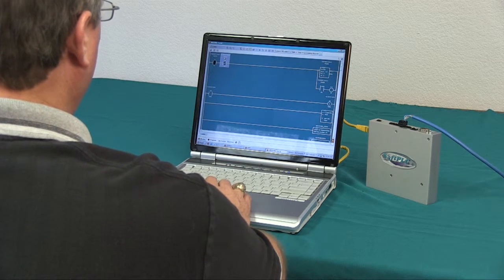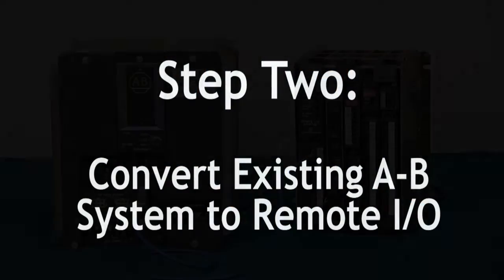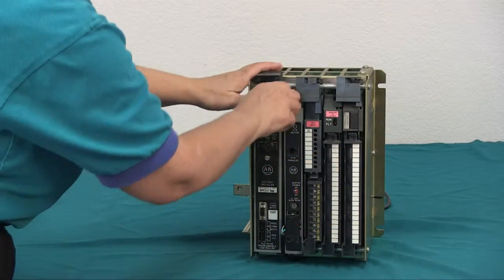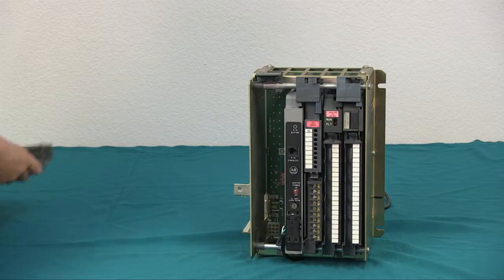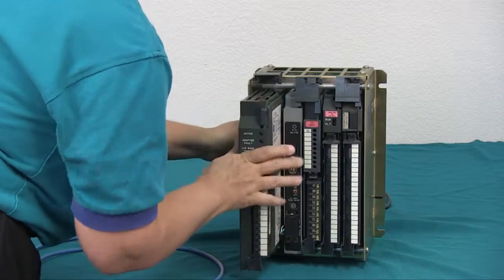We'll then make sure the program successfully loads into the Soft PLC, then ship your new CPU and programming software to you. Depending on your old PLC model, what you need to do will differ. If your starting point is a PLC2 or PLC3 with remote I/O, you're all set. If your PLC2 has local I/O, in each rack you need to exchange the local adapter, 1771-AL, with a remote adapter, 1771-ASB.